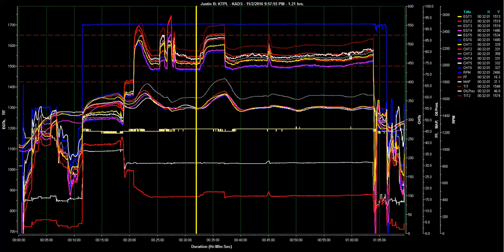Looking at the data here, we can see the number five EGT is a little on the wonky side. That could be a spark plug, it could be an ignition lead being burnt, it could be a valve starting to show health concerns, it could be a burnt valve, loose valve guide — something like that. It's just worn out. Take a look at that number five with the borescope very closely.